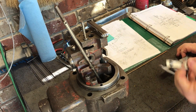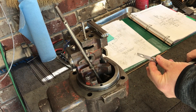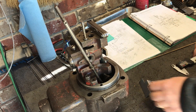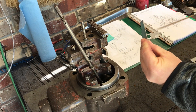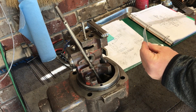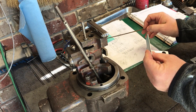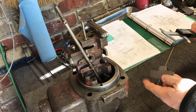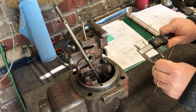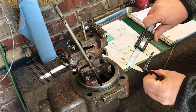I do not have a mill. I do not have a lathe yet — I need one. If anybody in the central or south Alabama area has a mill or lathe for sale at a reasonable price, let me know. I did the same thing with the bottom hole. The bottom hole is supposed to be 1.580 inches from the top of the hole to the bottom of the top. Add in the width of 0.063 and you get 1.643. And if I measure 1.643 — there it is, 1.643. So I hit that one right on target as well.